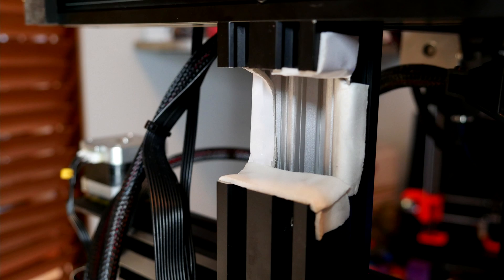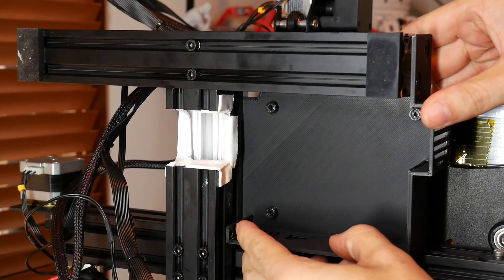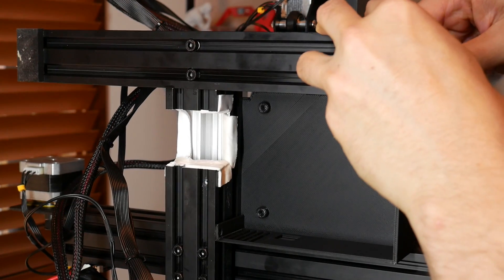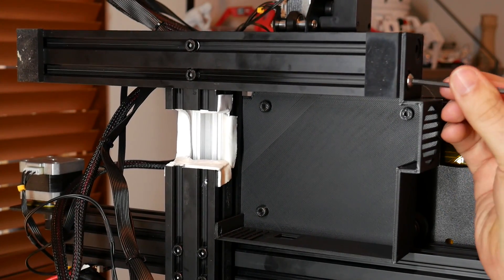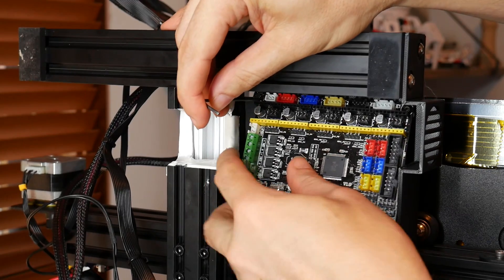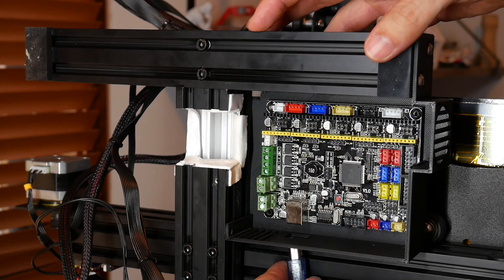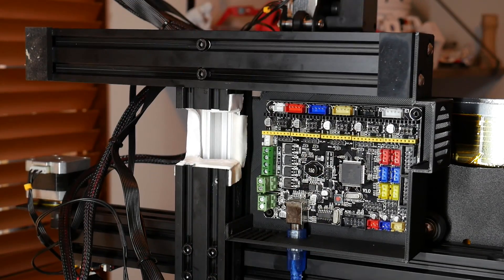Remember that the wiring checklist is in the description and you can print it out and use it when disassembling and labelling all of your plugs. Now it's time to reinstall the new mainboard. The cutout for the wiring on the underside of the printer has some pretty sharp edges, so I found foam tape and applied it to all of those sharp edges. First, slide our printed part into place — it attaches the exact same way as the factory part, which means two large bolts on the front and then one small bolt from the top going through to the extrusion. We now mount the MKS board on the tabs provided using the factory short M3 screws. There's a slot provided in the printed housing for the USB cable for firmware updates or for printing from Octoprint.